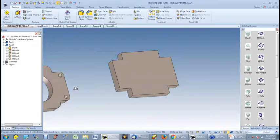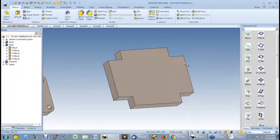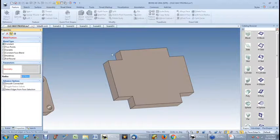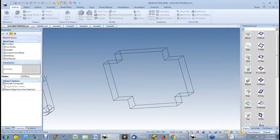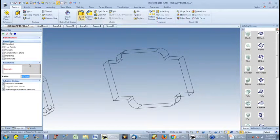If you remember the old profile, I had to sketch those holes. With IronCAD, I'm going to just drop them. But first I want to blend some of these corners. This blending technique is pretty much like all the others — nothing really spectacular here other than it blends. I'm going to create a 0.75 blend. The reason I picked wireframe was so I could actually see through the part.